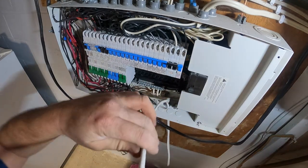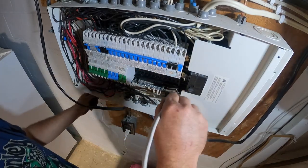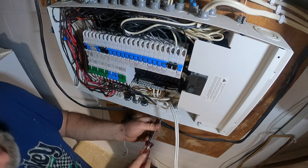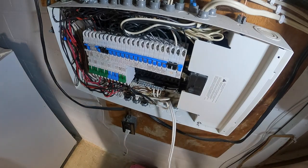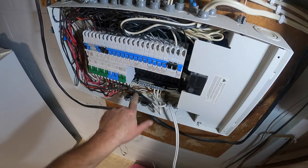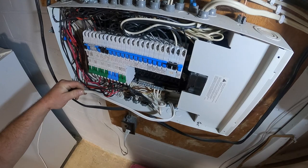When I'm hooking this up I'll probably stop talking because I need to concentrate. That wire's in. I need to get some wire staples to pound them down but for now that's good. We'll tighten up the strain relief — don't do it too tight. Now I'm going to figure out where I am. These are my 30-amp breakers for the trailer, so I'm going to go under them and catch the neutral bar and the ground.